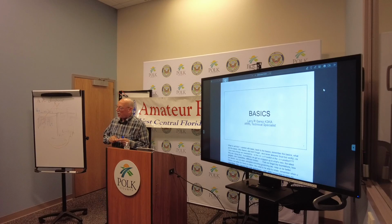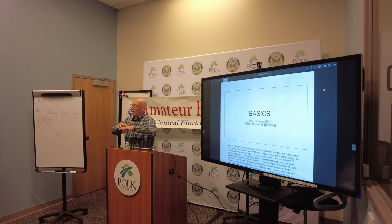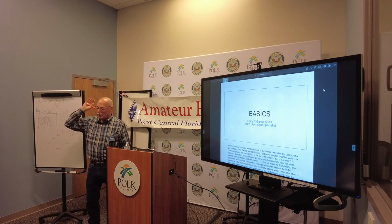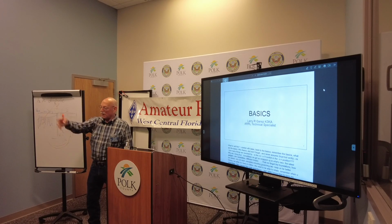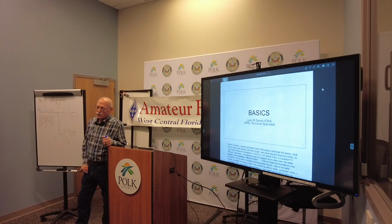The only exception is you will see sometimes, particularly in the south, tropo ducting. Sometimes it will follow storms, heavy storms, and then all bets are off. I sat in Cape May, New Jersey with my 2-meter antenna at about 15 feet above the ground, 13 element, and all of a sudden I'm hearing South Carolina, Georgia, and talking to them like we're talking here. All of a sudden I hear somebody in Connecticut coming in, and I keyed him up and I'm talking to him. He says, well, you're a little scratchy sometimes. I said, oh, you're off the back of my antenna.